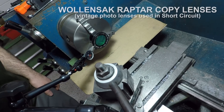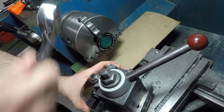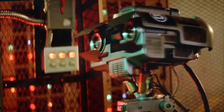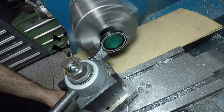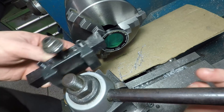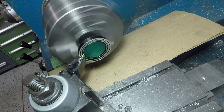First let's modify these eye lenses, which were donated to the project by Terry Andrews, aka J5 Guru on YouTube. These are the exact kind of lenses used in the movie, really key to nailing his personality, so we're thrilled to have the right lenses. We just have to carefully hold them in the lathe and modify them by facing off this engraving down to the bare brass. To allow me to power feed this safely, leaving a consistent finish, I'm starting at the inside and feeding away from the lens. I also find this generally tends to leave a better finish.